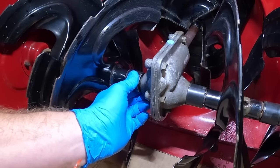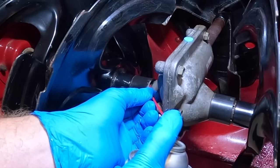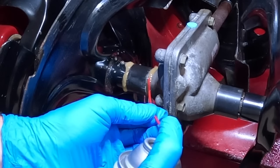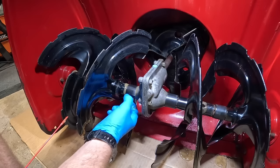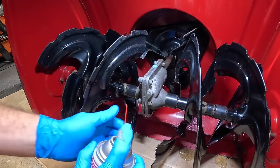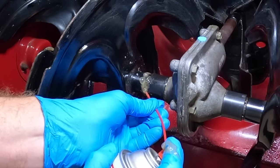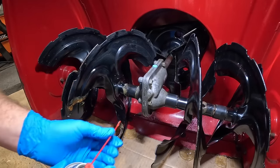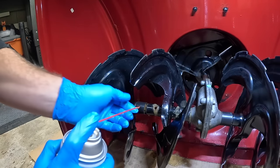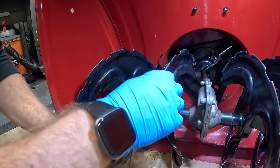Pull the spacer back and get the red straw in as far as we can and hose it down. It's coming out the other side — that's beautiful, just the way we want it. Spin it around a little bit. Now push this back toward the gearbox and try to weasel this straw underneath the auger. You'll notice a definite different sound when you start spraying if it's getting underneath. Push the auger as far as you can to give enough room — that auger spins really nice and smooth now.